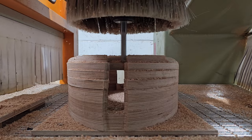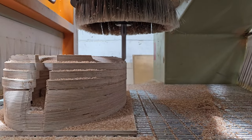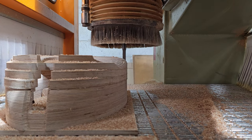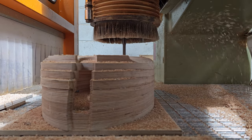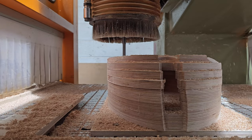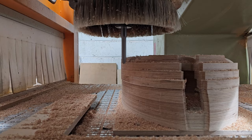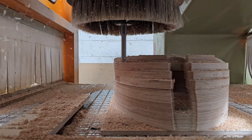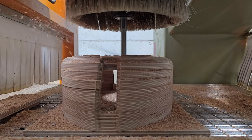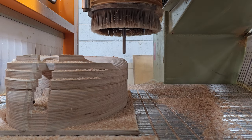So I had to employ a separate tool path just to do this top little section of roughing and tell it to hack all that out. What I'd usually go for is parallel Z contours. So it'd just work round at one Z level, doing everything at that Z level, and then moving down. As you can clearly see here, it's dropping down, and it's doing X, Y, and Z all at the same time. That's why it's choking up a little bit. Hopefully, in a minute, we'll head round to the point where we're doing the simultaneous three.